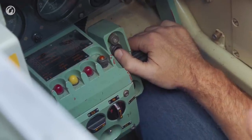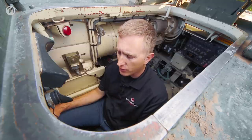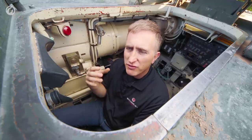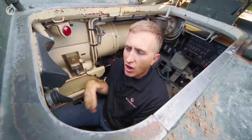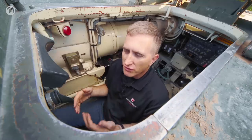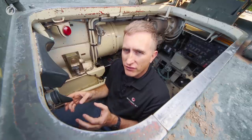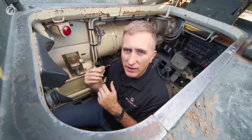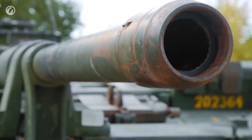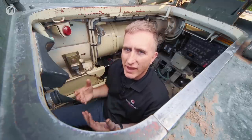The loading cycle is about three seconds, a little bit less. In practice, engagement times are probably going to be a little bit longer, partially because of obscuration and partially because the tank is rocking backwards and forwards. If you maintain pressure on the trigger as the tank fires - basically a follow-through - the suspension will figure out where it is compared to where it was and resettle on the last point of lay. One of the nice things about the autoloader is that all ammunition is immediately accessible: if you fire ten rounds on a Centurion you're scrambling to find ammunition scattered around the tank, but with the S-Tank every round is available until you run out completely. The gun itself is a 62-caliber length modification based on the British L7 rifle, adding a little more velocity, accuracy, and punch. The Swedes built their own ammunition.